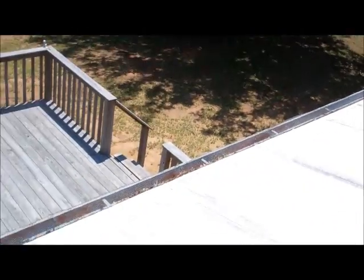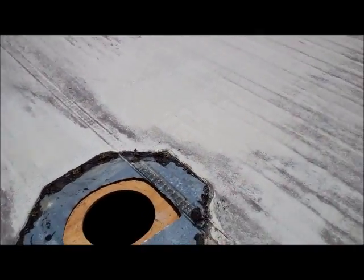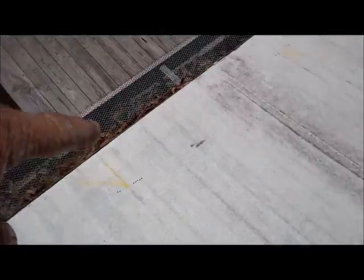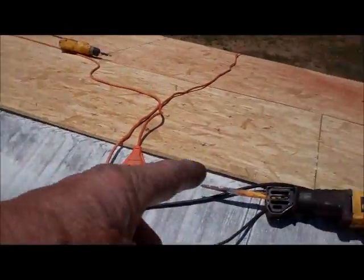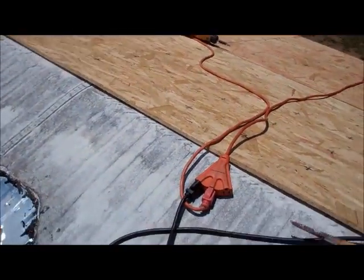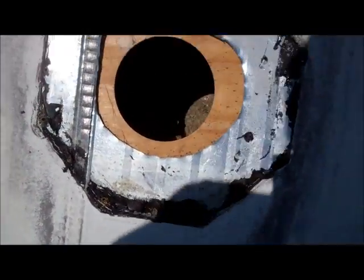Anytime you're on top of your mobile home or somebody else's, or if somebody's on your mobile home, the most important thing, obviously, because it's not all plywood underneath there, would be to find your rafter. We mark all ours. And then we have them marked at the top through the other side because they join there. And we always try to make sure we step on them and don't get off them.